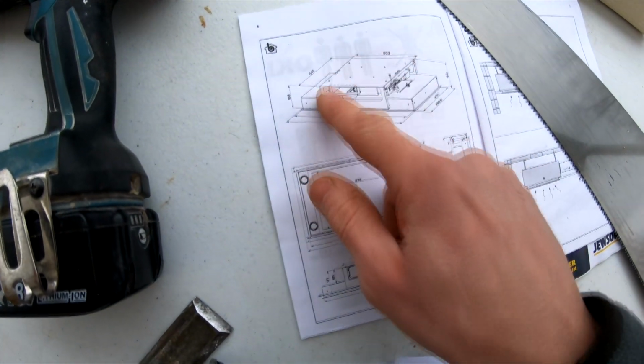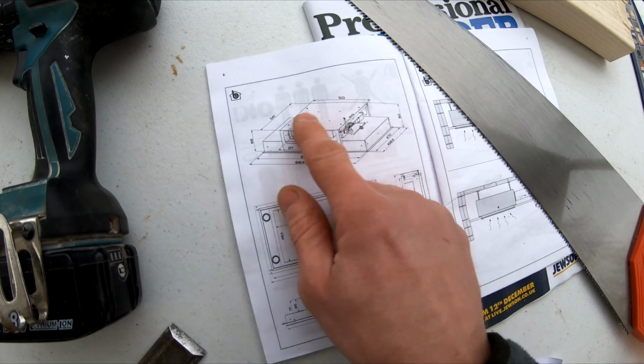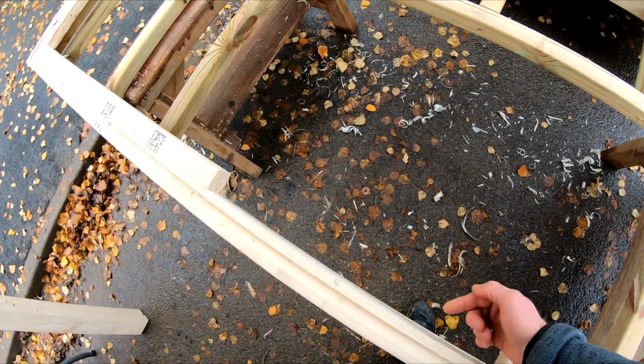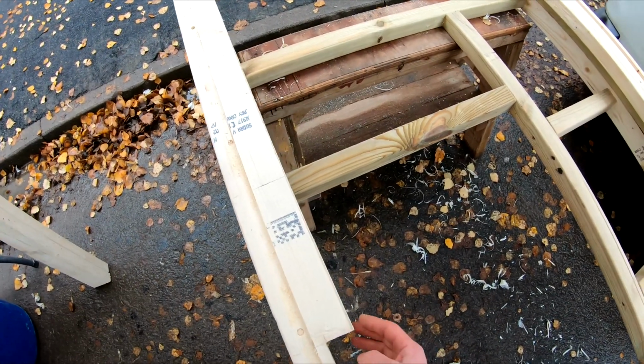So guys, there's been a little change with our frame, nothing too serious, but as with all building, there's always some modification that needs to be done just to make sure the finished product is absolutely perfect. So what we hadn't anticipated is the actual width of this. This is the motor for the hood. It's actually wider than the actual surround itself. So what that's meant, to ensure that our hood lines up with the hob below it, we've had to take a section of this frame out, and I've also had to reduce this in slightly.